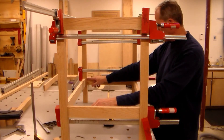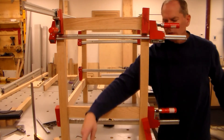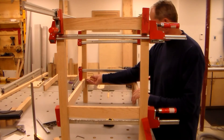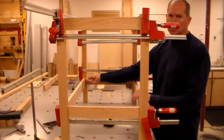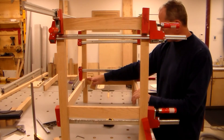Like I said, I want to notch the leg right there to accept the shelf rather than having the shelf wrap around the leg. I want the shelf to go in through the leg — I'll cut this back at 45 degrees, three quarters of an inch. That'll help the shelf set back in there a little bit and you won't see a line wrapping around as you're looking down — a little bit of extra work but no big deal.